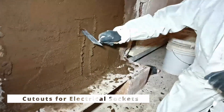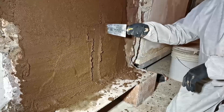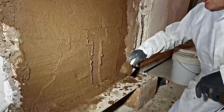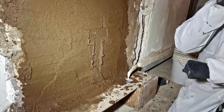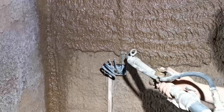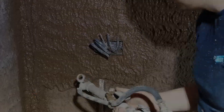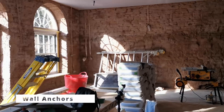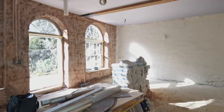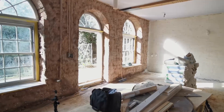Cutouts for wires, pipes, and electrical sockets. Especially in underground areas, cutouts for cables or electrical sockets can be weak points, compromising the integrity of waterproofing and leading to potential water ingress problems along these points. Applying the Rinzaffo MGM base coat first before the rewiring creates a breathable waterproof seal throughout, keeping liquid water away. If the rewiring has already occurred, the Rinzaffo MGM plaster can still be used to seal these problematic areas. For wall anchors — for example when hanging kitchen furniture onto the walls — they can be used without a problem, but the area around each anchor must be sealed with the Rinzaffo MGM plaster. This prevents the transfer of water and salts into the main decorative lime plaster layer, keeping everything nice and dry.